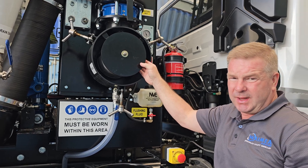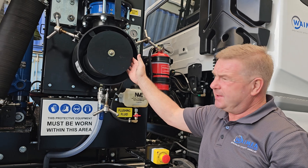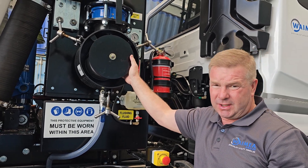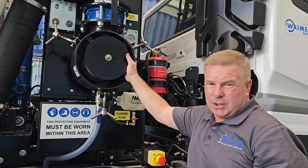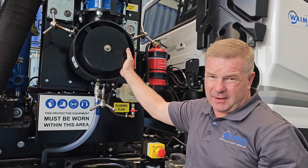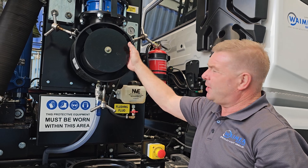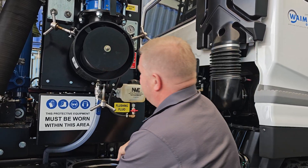We can undo that with a crescent and take it out and wash it on site if we need to with our pressure cleaner. Always check and make sure we don't have any compromise — if there's a compromise in the filter we do not use it. Normally your company will have a spare one on the shelf, otherwise we can send one overnight. Really crucial — if there's ever a compromise on there we don't use it. Wash it out, it can be put back in wet — it's not a problem. Then we do this back up.